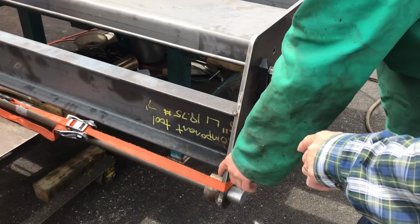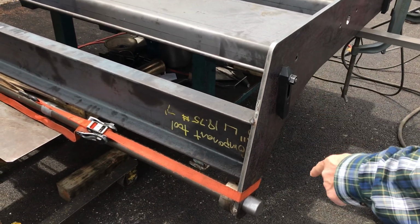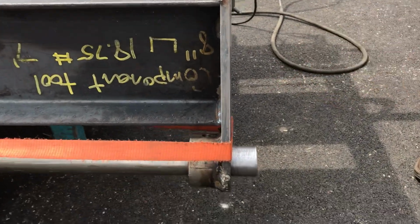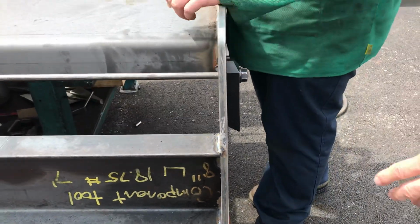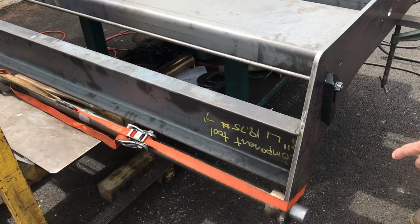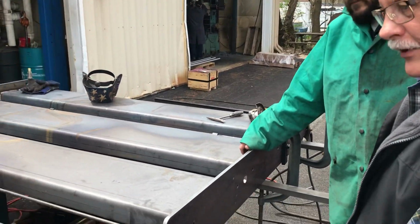Yeah, there's some bushings, and that helps align everything. Those are thicker than what the plate is, because those holes bored alone in a 1/2 inch plate wouldn't give much guidance. But these things here have bigger bushings there that line it up, and what goes in that bushing there ultimately is going to be a 4140 alloy pin that sticks out, and it fits in a pillow block.